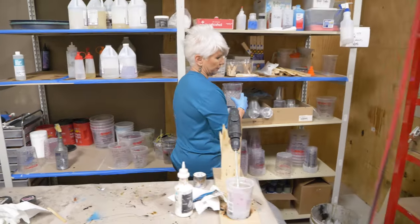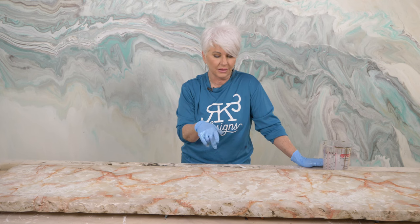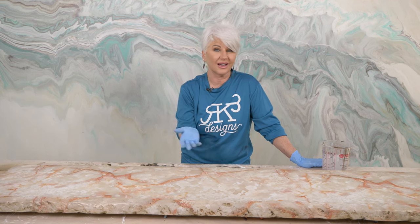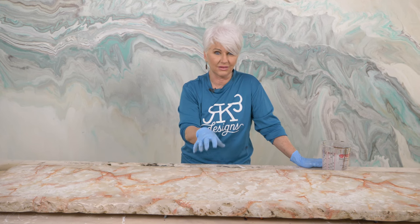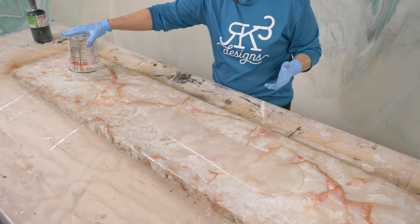We're going to come back with three ounces per square foot of our Art Coat epoxy by Stone Coat Countertop. I think I'm probably going to go one more step and apply the Ultimate Top Coat matte. Let me know what you would do — would you go with gloss or matte? Technically we don't have to put the UTC because this is just a little sofa table with not a lot of high traffic, but I want a matte finish, so — matte it is!